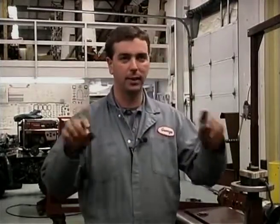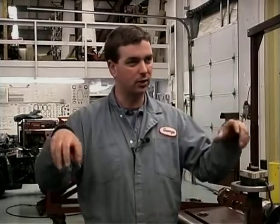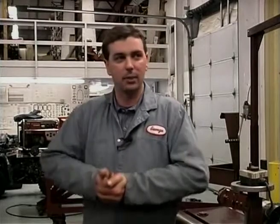That's my up and down. I put the dual indicators on to do forward and back. As soon as I move the 2 knobs, I'm ready to grind. And that makes that particular system fast. It gives me that relief option that I really feel is important. And I can also spin grind, which makes a perfect cylinder. So it's like the best of all the different worlds.